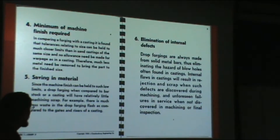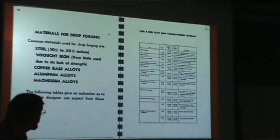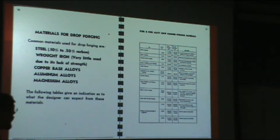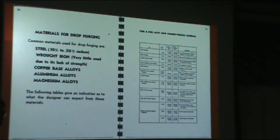We talked about already the minimum machining, savings of material, the issue of closing up shrinkage cavities and other types of internal problems. Again, that's largely going to happen during preparation of the stock, not as much during the forging of a closed die forging. Really any of the materials we would use in an open die forging application could also be done with closed die work — pretty much anything.